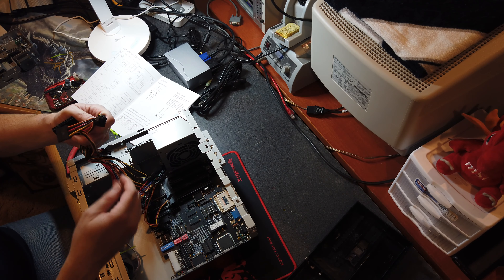And we are booting into DOS. You may notice there is only 640K of RAM - I need to install a special driver to see the upper memory and use it, then I can load most of DOS into upper memory and I'll have something like 10K of used conventional memory, which is kind of an interesting feature of this device. It works! Let's put some cards in and boot it up again.